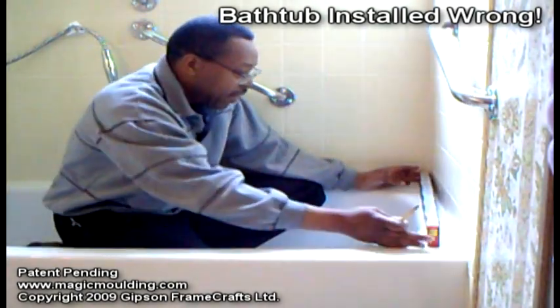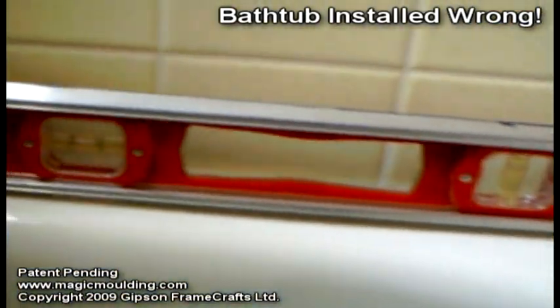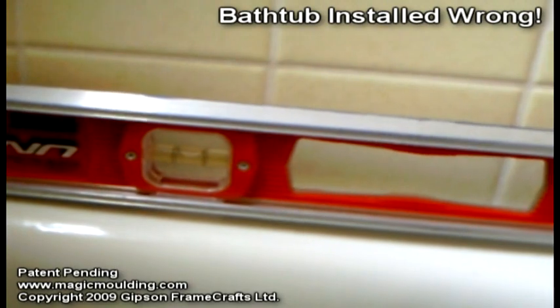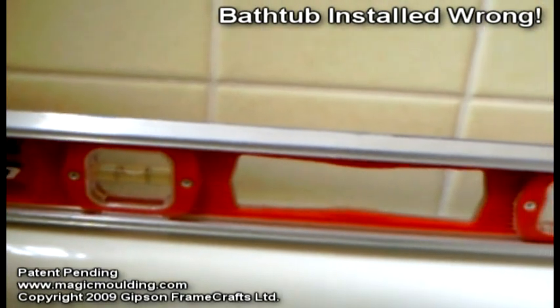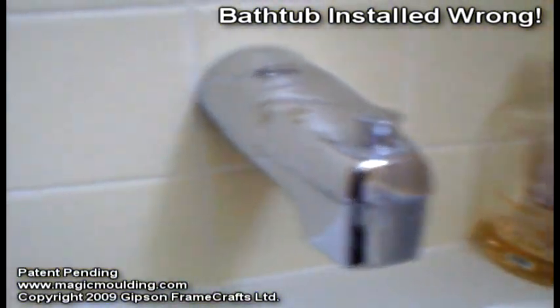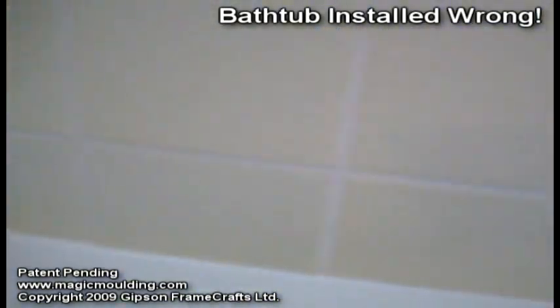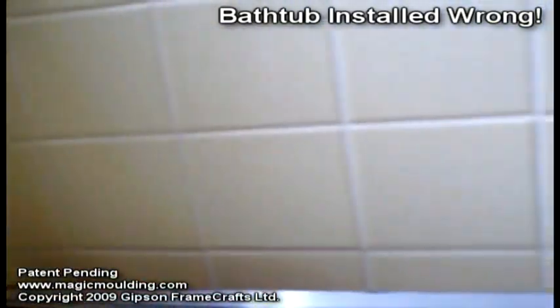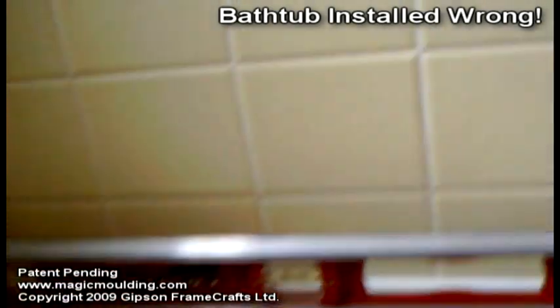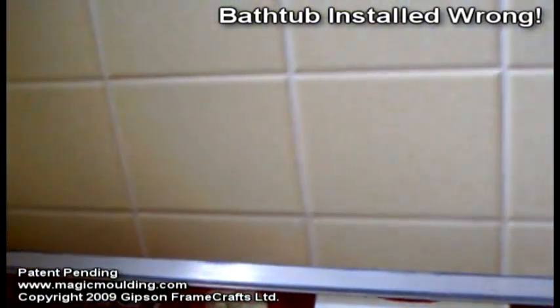Now let's have a look on this side. I've got a pencil sitting under the level and you can see it's still not level, so it needs to be up even more than where the pencil is. If you look at the grout and the tiles, you can see the lower ledge of the tiles are properly distanced from the tub about an eighth to a quarter of an inch. Any water that's on this ledge — without this pencil in here, because it's tilted like this — all the water is going to drip off the edge of this tub.